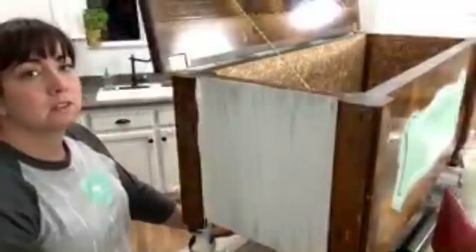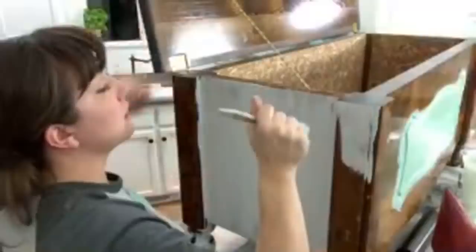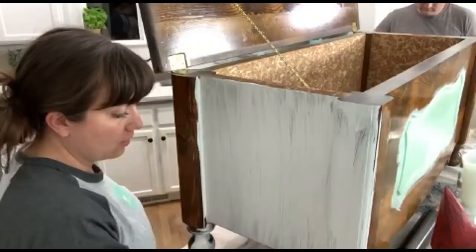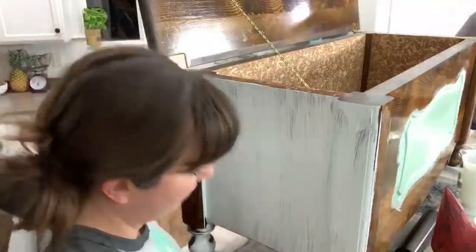I'm going to set the camera up so they can watch me paint while I answer some comments. The color on the shutters above our cabinet — that's a mix of Sweet Pickens milk paint: Sweetie Jane and Pantry Door. All three of the paints we use can be painted on most surfaces. This chest was pretty shiny and we didn't do any prep other than clean it. You don't have to sand, but if you want to sand, I'd sand and then shellac so you don't get tannins from the wood coming back through.